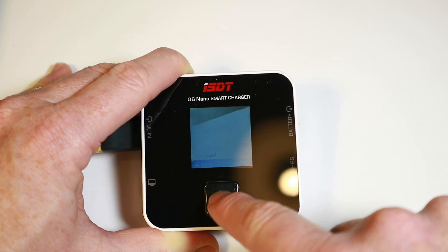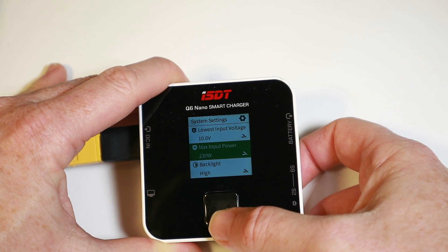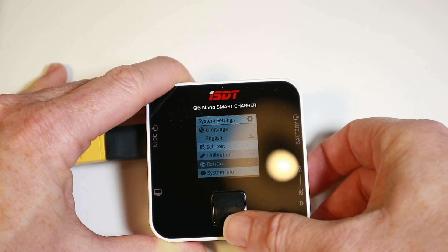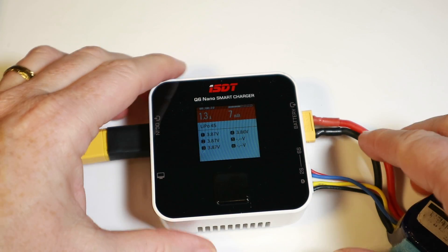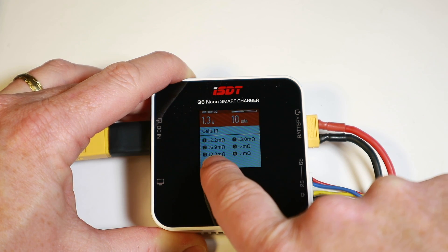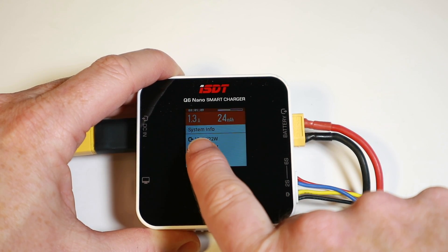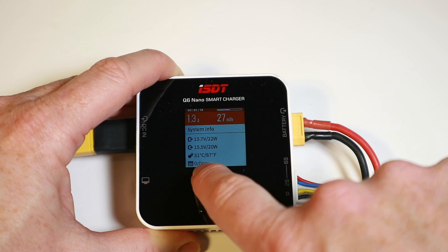In system settings we have lowest input voltage, max input power, backlight, volume, completion tone, self-test, calibration, and a 'BatGo' option. Putting the battery back on charge — like many other chargers, as it charges it works out a few things, so we can get the internal resistance measurement. We're seeing 12, 16, 12, 13 milliohms — not great, but this is a battery from 2016, so actually not bad.